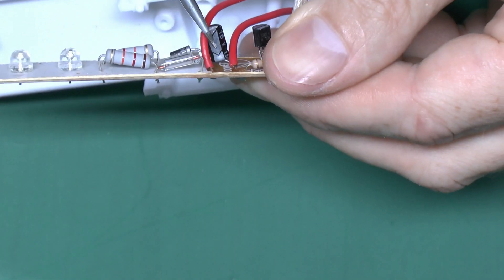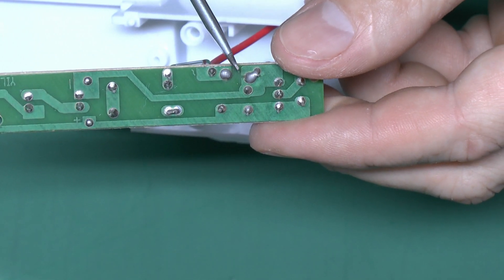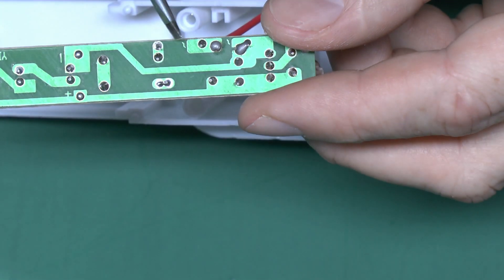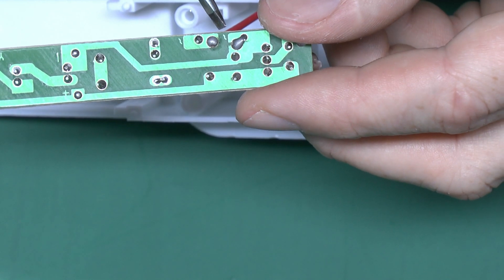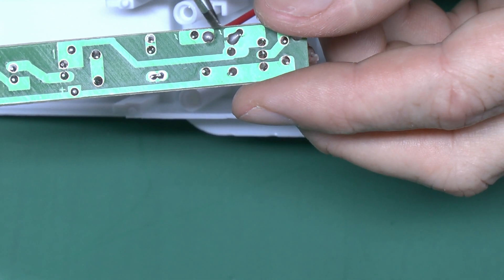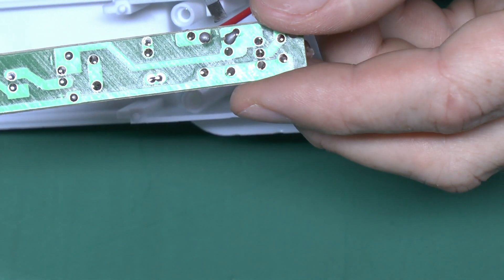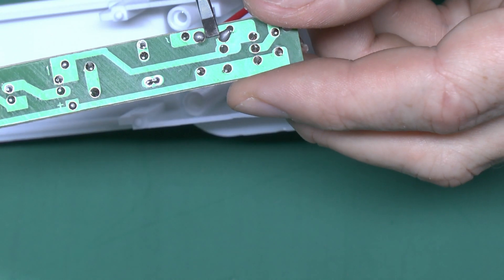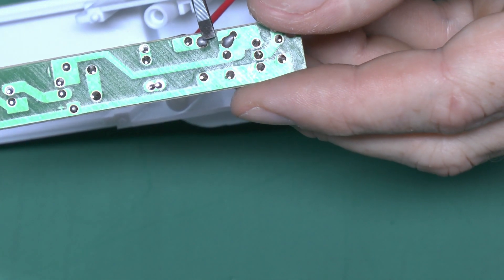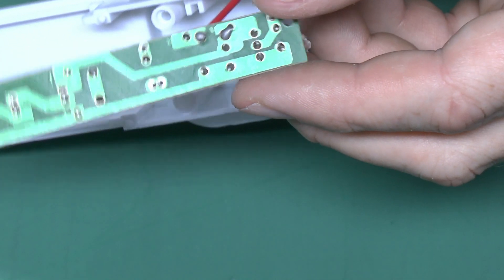So your line and neutral with these two terminals on here — there is a certain clearance, although there seems to be a little sliver of copper put in the middle there. Oh I see, it's the symbol for AC, which unfortunately they've put in the centre between the line and neutral pins, so that's probably compromised the actual space between the two. So not ideal — that should be erased. In terms of width, this is a 3mm screwdriver, so just about 3mm, not including the track. Without that it's going to be probably about a 2mm clearance, which is certainly not ideal, but we've seen far worse.